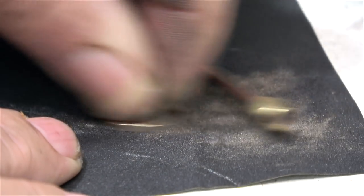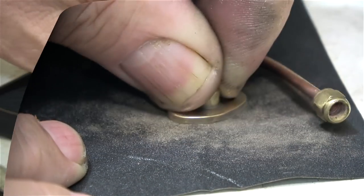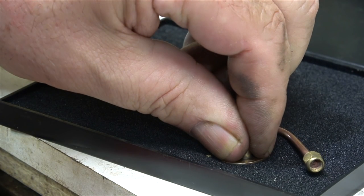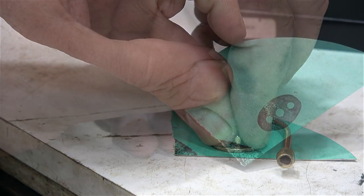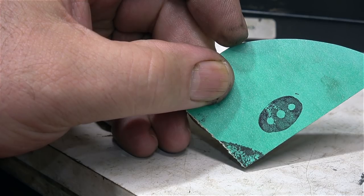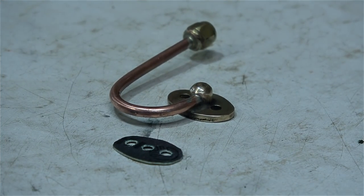I'm cleaning up the mating face of the flange on a piece of wet-or-dry sandpaper, after which I press it on my ink pad, then I transfer the image onto a piece of gasket material. Once I've punched out all the holes using a hole punch and cut out the shape from the gasket material using a pair of scissors, it now looks like this. That's it for this episode — I'm going to go out and see if I can find some paint that's the right colour for the boiler casing.